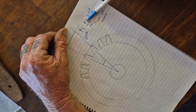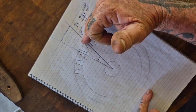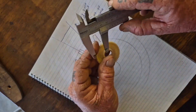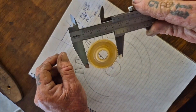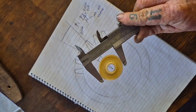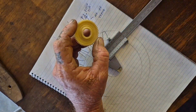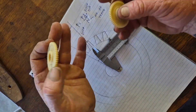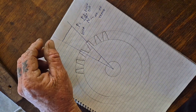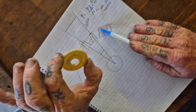So, pitch diameter — what exactly is pitch diameter? Your first thought might be the overall diameter of your gear, but it's actually not. You don't measure gears by their overall diameter, although their diameter does factor in how they work and how they adjust ratio. Your pitch diameter is really quite simply this: on my crude drawing I've got an outside diameter of a gear.